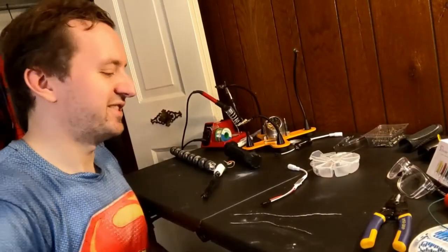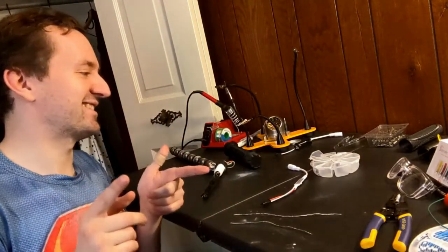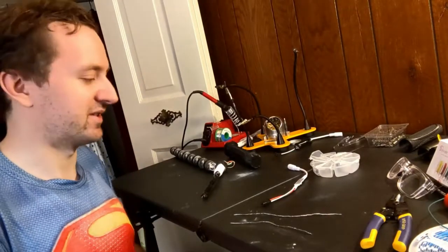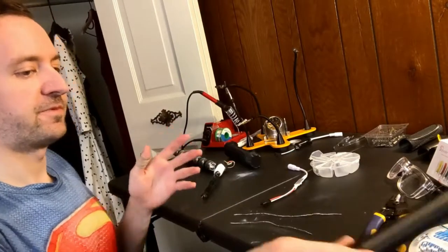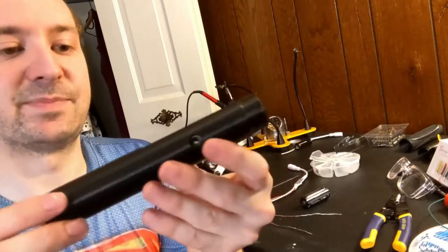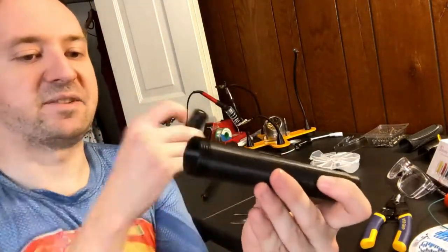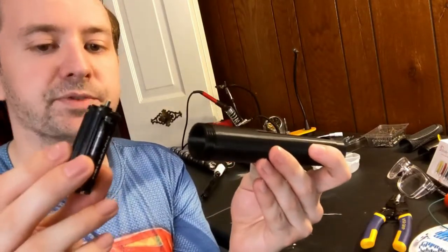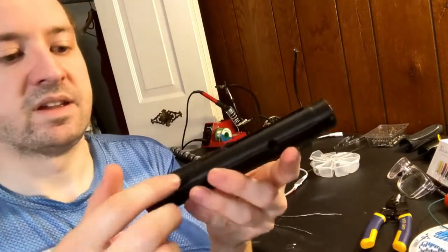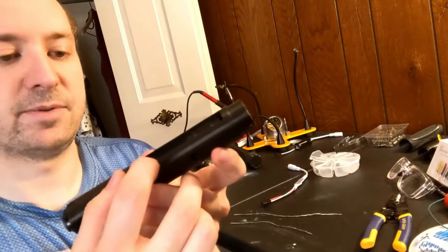And we are now working on the electronic portion of this build. We have all the parts, I think, necessary to complete this build. Let's walk you through how it all works. So, right here we've got the chassis, what I'm calling the chassis. It's made out of rubber TPU material. At the bottom we have a cavity that will fit a cylindrical battery pack that holds 3 AAA batteries, slides right in, like so. Out will pop a couple leads, which will connect to the smart LED chip right here,